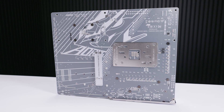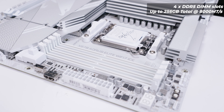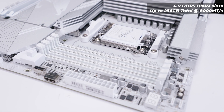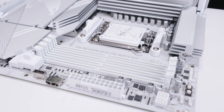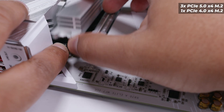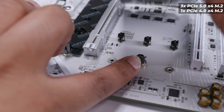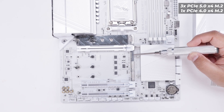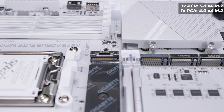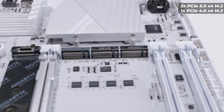On the back side of the board, the PCB is gray rather than white, and there's not much going on back there. RAM is interesting — four DDR5 DIMM slots supporting up to 256GB in total, so it does support those new 64GB modules. For storage, the board is set up for tool-less drive installation. Pulling the heatsinks off — they're all spring-loaded clips — the most interesting thing is that the M.2 slots are now labeled directly on the connectors. Slots without a label are PCIe Gen 4, while labeled slots are PCIe Gen 5.